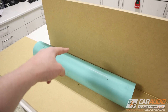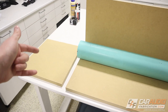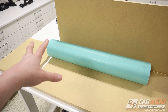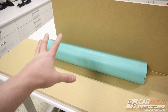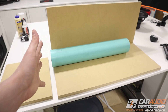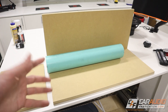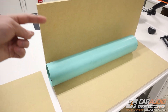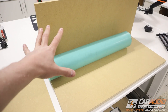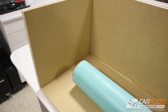Now, the first thing to assume is that we're building a ported enclosure. I've mocked up three different sides here to show these advanced techniques. This leads to an important point: you want to do the port mounting before you completely finish the enclosure. A common mistake is building all six sides of the box first, then trying to cut the hole and mount the port. Don't make that mistake — attach the port while you still have access inside.